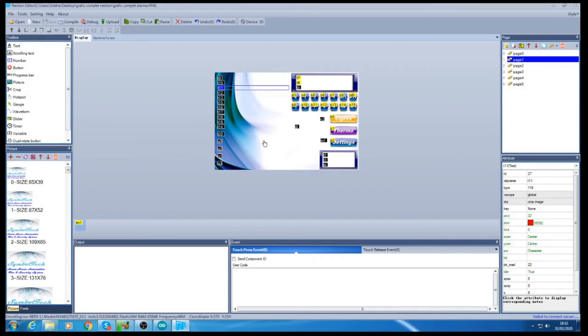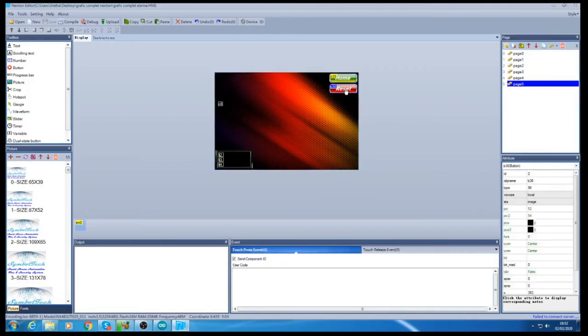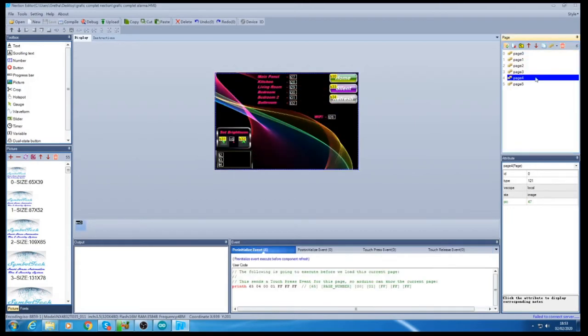And if there is not a real fire, you have time to come back to the panel, put in your pin, and once you insert your pin, you press OK. We're going to jump straight away to this page where you just press reset, and the alarm will be reset so the bells do not ring. And here I have, this time when I go to the display, to keep the same brightness that you're going to set up from the settings page, which is this one. It's page number 4.